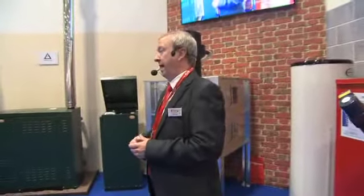You can flue into a chimney, but you would need to use one of our flue packs. We do a smooth bore liner pack that you would need to do. You just couldn't use any system, because it's a condensing boiler, there would be so much condense running down that chimney. That's why you would need a liner to do that.